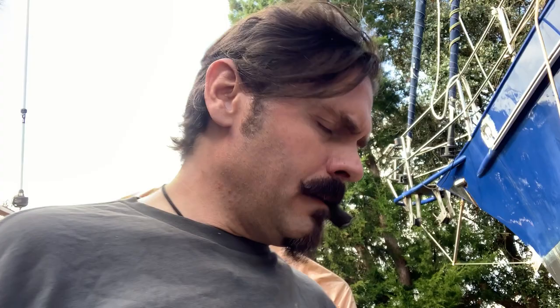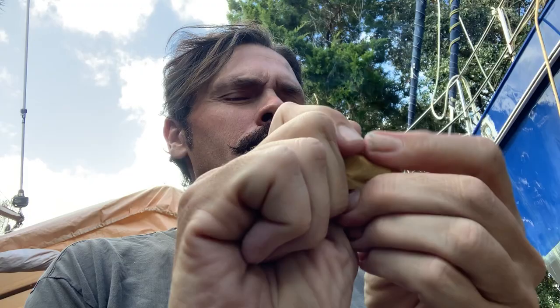Here's a tip for you guys. If you're trying to sand something with complicated curves and stuff like that, wad up your sandpaper. Just wad it up, get it all wrinkled and softened up. Sometimes the edges here can scratch, and we don't want that. So I wad it up, make it really soft and pliable. And that'll help me get into these curves and all around this, because this thing is very curvy. So we want this as pliable as possible.